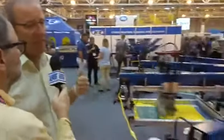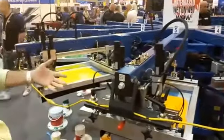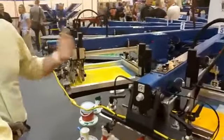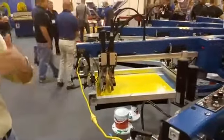And first of all, as you can see, there is no water to spray, etc., because spraying water is going to affect the ink, because it's going to change the balance between the components. So it's just an immediate solution, but along the way it is not the perfect solution. So we don't want to use the water. It has to be used only for washing the screen, cleaning the screen. That's it. Well, many people, of course, as the ink gets thicker throughout the day, just add more water to the ink. This is, in my opinion, a wrong situation. It's solving the problem at the moment, but the additional water inside the product is going to change the balance inside the ink.